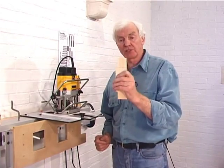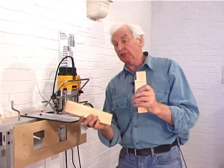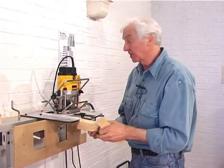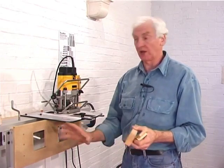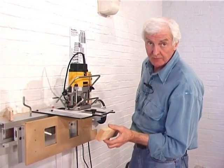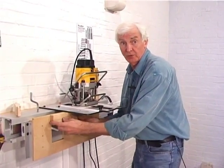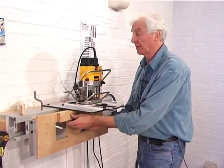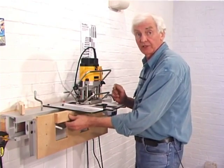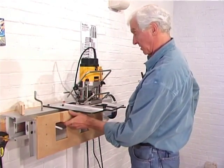If the tenon is cut vertically, the mortise is usually cut horizontally. And for that, you need to make some kind of mortise rail or carriage to hold it. You make the mortise rail, using the Woodrat, of course, and it allows you to put the work in horizontally in front of the cam clamps and the fences. And the rail can act as a router fence, so you can run your pieces through to make the grooves.